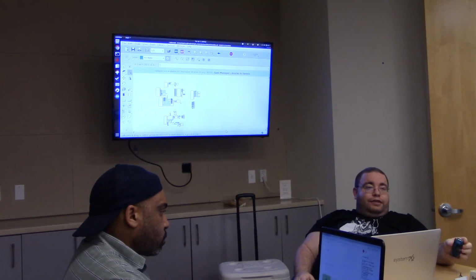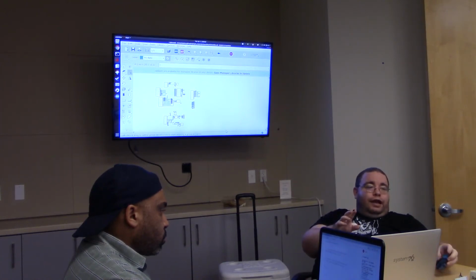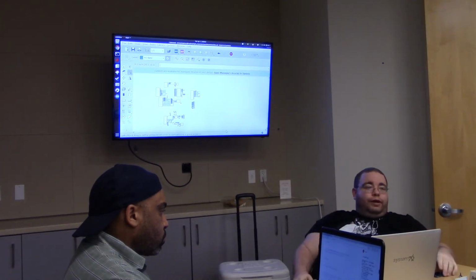So I'm going to do a little bit like that. I'm going to tie the low 2 blue pins together so that I will have only 4 values of blue, but I'll have 8 values of red and green. So now I've got 8 bits per pixel. And you can't really tell.